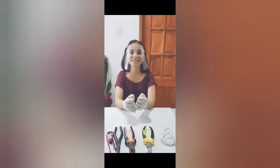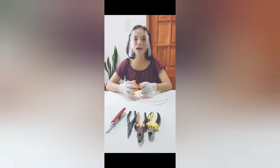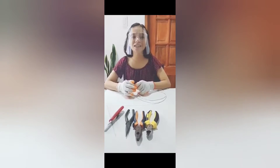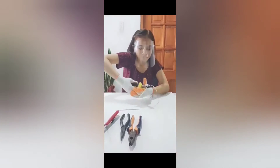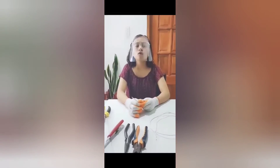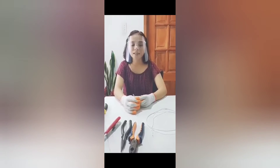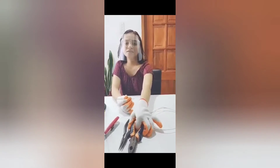This is the Western Union short tie splice. Number one, cut two pieces of number fourteen insulated wire at least six inches long. Remove all the insulation of the two wires at least four inches using a knife and combination pliers to avoid hand injuries.